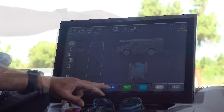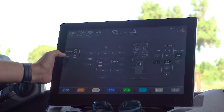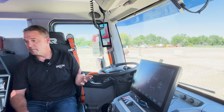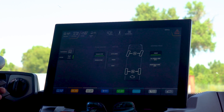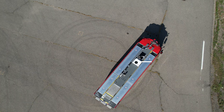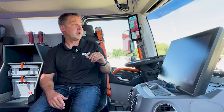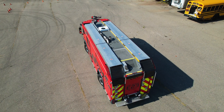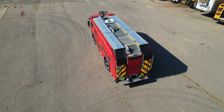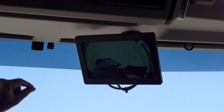You can turn all scene lights on and see a display showing which are on or off. Other features include HVAC control, light color and density adjustment, and manual start of the battery saver or range extender. From here you can also engage the front differential, rear differential, all-wheel steer, or crab mode. All-wheel steer means both front and rear wheels turn to shorten the turning radius — great for cul-de-sacs and tight locations. Crab walk makes both wheels turn in the same direction, letting you ease into a lane or parallel park.